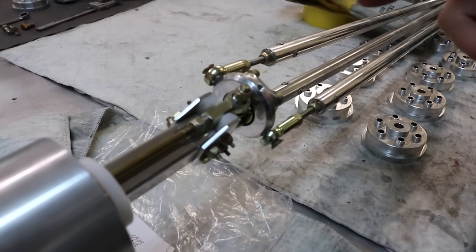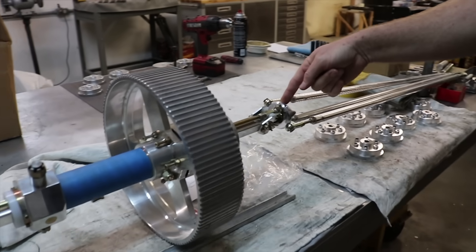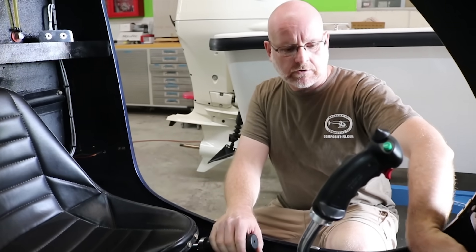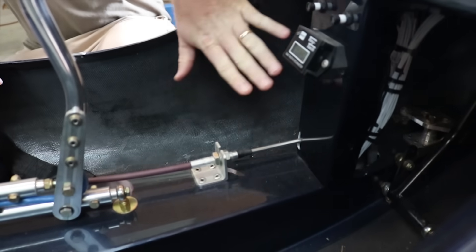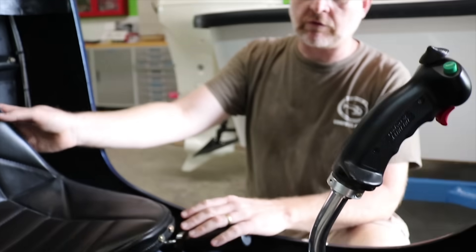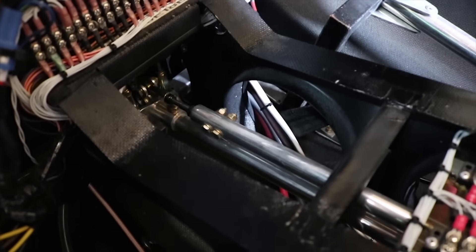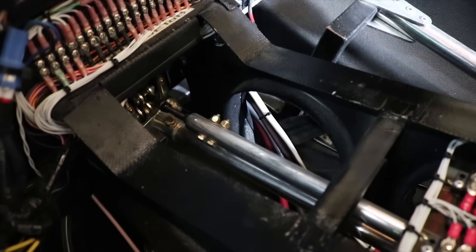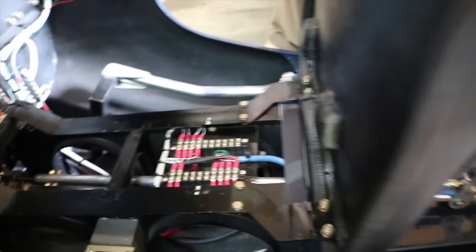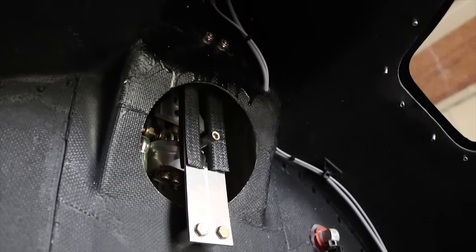This is what the operator is flying. You're seeing it in a configuration where it's on its ear, but this is our final pulley and just underneath it through our control structure is our swash plate. Our machine is a conventional helicopter — we have a cyclic and a collective and typical foot pedal controls, all cable controlled. Taking off, given the way our rotor spins, you want to give a little left pedal when picking up. If you move the cyclic around, you can see it's inputting into the tubes and moving up to the swash plate — the swash plate mirrors exactly what the cyclic is doing.